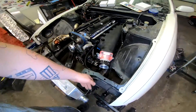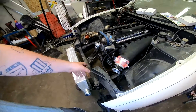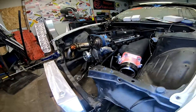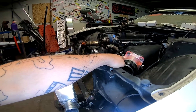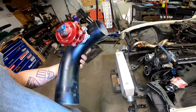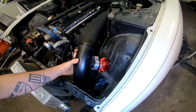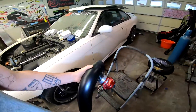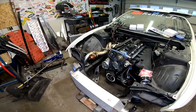On this side, we're also going to do a transition — this is three and a half inch and this is three inch, so we'll make a transition from three and a half to three inch. He has a three-inch alpha lock for that and a three-inch alpha lock for the other one over there, so we're running full alpha locks on this thing, which are super pricey but super nice. I have an old three and a half inch piece from my Trans Am with a blow-off valve that we might actually use. Once we get it all chopped off, we'll see where it fits. This whole front end is going to be tubular.